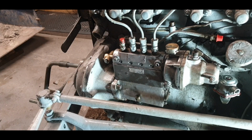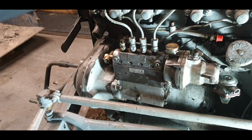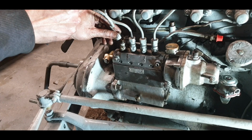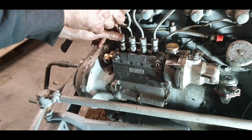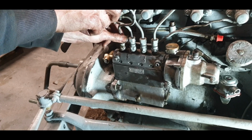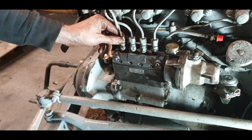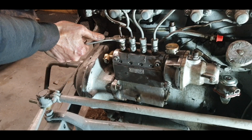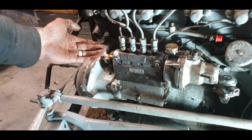Okay. Blowing out, lovely. Off with the cap. This is called, in the workshop manual, a swan neck pipe. So I like to just turn that out there because that's going to be running diesel out of it. And when it stops dripping, as I was twisting the pump, that's known as spill timing. So I put a container underneath that.